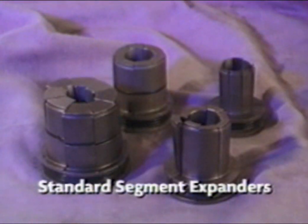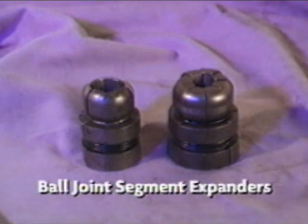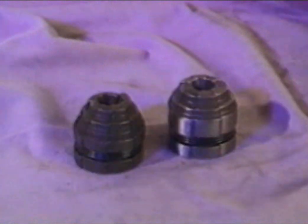Standard segment expanders are used to make straight expansions on tubing ends and mufflers. Manifold flange segment expanders are used to make donut-type manifold flanges on tubing ends. All manifold segment expanders are used in conjunction with limit rings. Ball joint segment expanders are used to make ball joint expansions on tubing ends. They are available in 3 different sizes.